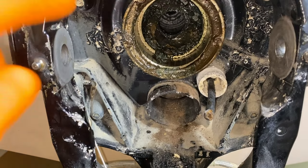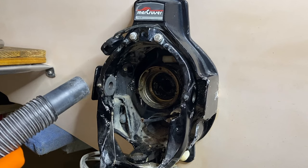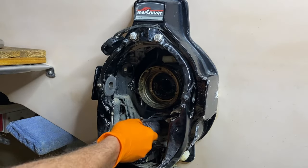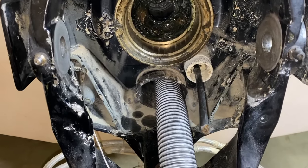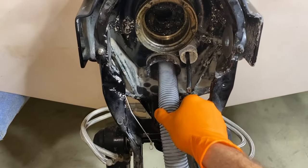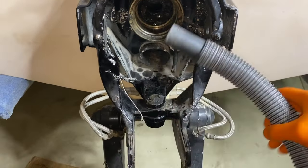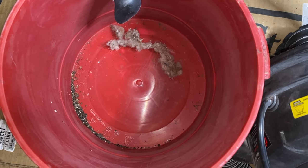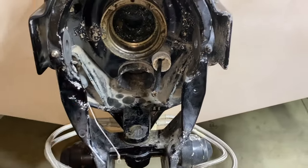At this point, the entire bell housing, water tube, U-joint bellow, exhaust bellow, and shift cable bellow have been fully removed. Before taking it to the workbench, we're going to clean up the entire inner portion of the housing — honestly it's not that bad. There are a few areas of flaking and pitting but mostly in decent condition. Using the Craftsman shop vac, I spent about a minute and a half vacuuming, inserting the hose as far into the exhaust system as possible. Not much came out, which is a good thing. We'll run an endoscope through the exhaust system to verify.